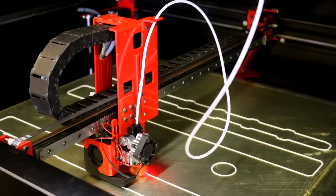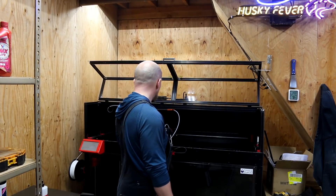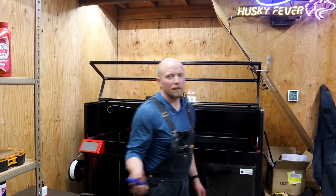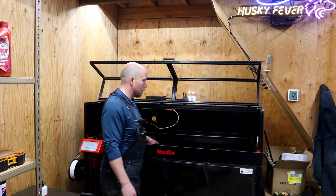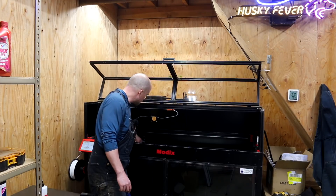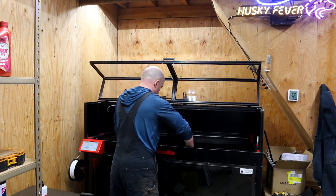I'm multitasking today because the print's going to take so long, and while I was working I flipped the breaker the printer was on and killed the power to it. That totally sucks — it was about two hours into a print and we only have so much filament. I'm going to look and see if there's a power recovery. Good news bad news story — it does have a power outage mode, however it has to be configured in the g-code before you begin, so it knows to save its location if it detects a low voltage situation.